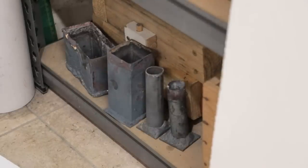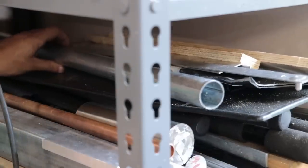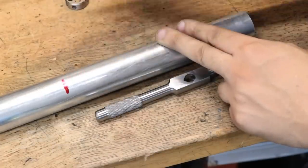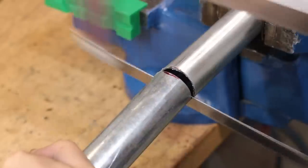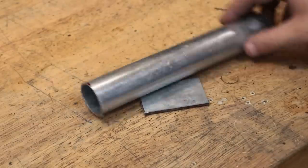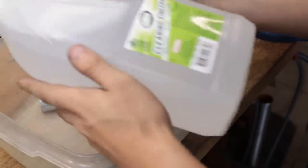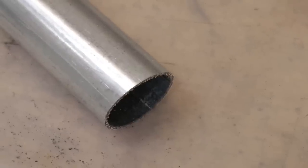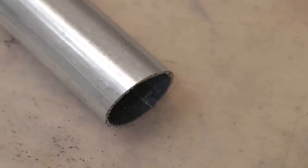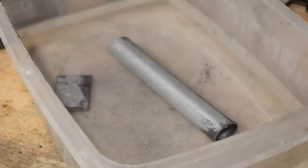I'll first have to make a packing box for the part, since none of my current ones were a suitable size. I have a piece of pipe on hand that is the perfect size for the job, but unfortunately it is galvanized — not really great for welding or case-hardening, since the zinc burns off and creates gas at high temperatures. I've had a few people tell me that vinegar dissolves galvanizing, and I thought this would be a great opportunity to give it a go. It started to bubble after the first few minutes so I left it overnight. However, it didn't seem to work as well as I was expecting. The ends are pretty good — it stripped that clean — but the middle part is pretty much untouched.